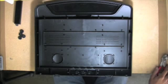For this installation, you'll need to remove literally everything from the canopy, including splash guard, reflector, fans, ballast, power cords, everything. It's going to need to be a completely bare, empty canopy before you begin your work.